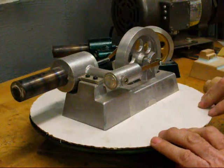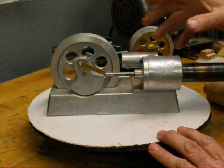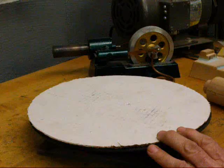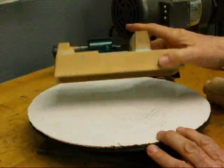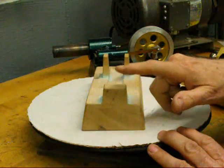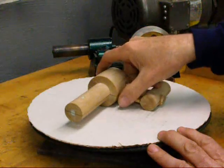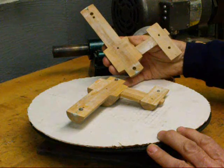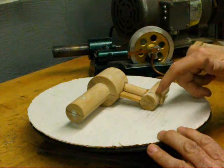But the air-cooled models almost always tend to run hot, slow down, and quit on you, and you're so much better off with a water-cooled, which I'm going to bring up and show you here. But first of all, here's the patterns. This is one that I made quite a long while ago. Got a base pattern here with the uprights for bearings and the pedestal to hold the working end of it. Here's the split pattern that is used to make this working end, and the displacer side here, and the power side or piston here.